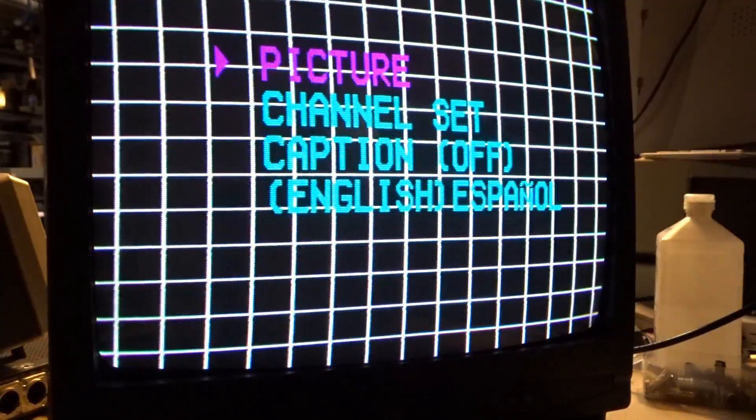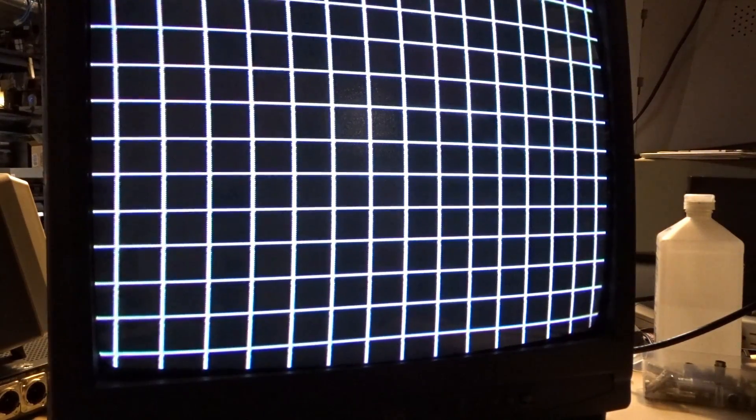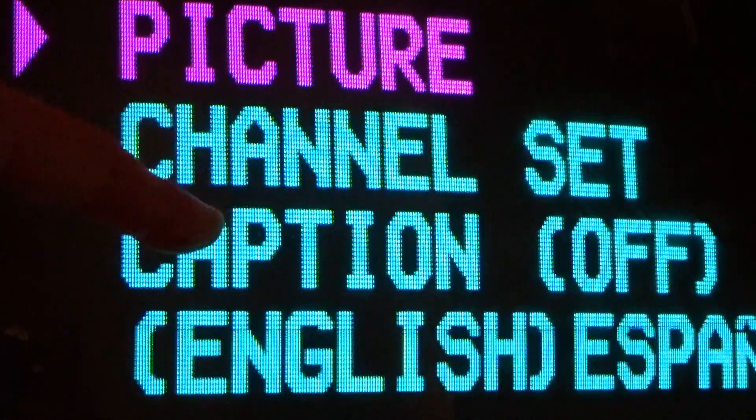Okay, so we're showing the menu on top of the color bars. Let me pick something else — a little easier to see. Okay, so there we go. We got a crosshatch with the menu on top. If I disconnect this gray wire entirely, we get nothing — no picture. Now, if I connect it to the 1.38 volts, there we go — we got just the menu. So right now we're looking at a pure RGB signal, meaning this is what we're going to use when we want to look at the input from, say, the PlayStation or whatever. And if I take this wire and ground it, then we get the crosshatch and notice there is no more menu. The on-screen menus are being suppressed and we have a pure composite input. Something else that gives me hope is that while this is being overlaid on top of a crosshatch or any other picture, the RGB was not very sharp — it was kind of fuzzy around the edges. But now, when we're running it in full RGB mode, the crosshatch is completely hidden. I like how sharp everything is here. This is a crap television set, but generally this looks pretty good.